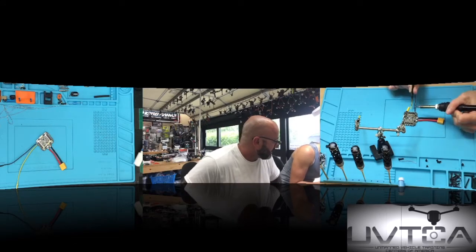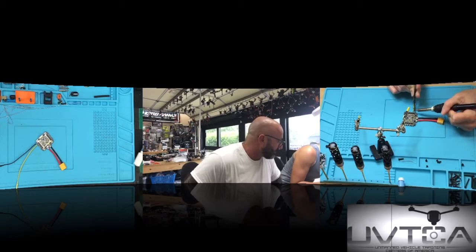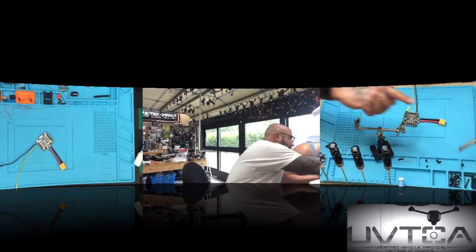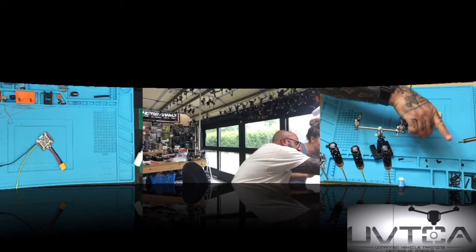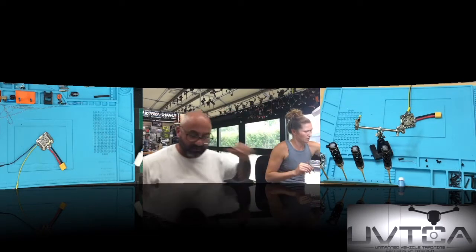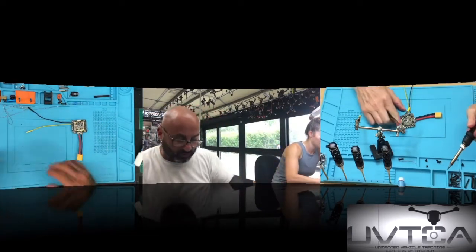Now, before you put the soldering iron on there, just put the wire on there. Rest the iron on top of it. You want to go a little past it. There you go. Let go. It came out great. Try to aim for 5 millimeters behind where you're touching it, because it's much hotter behind. That's excellent though. It looks great. So it's a smooth movement.